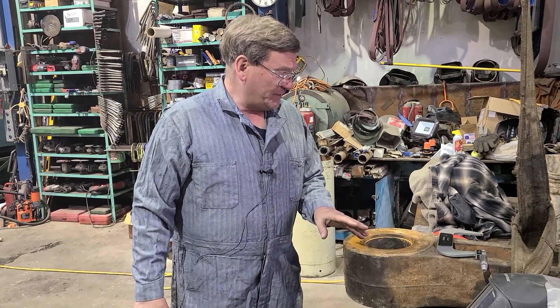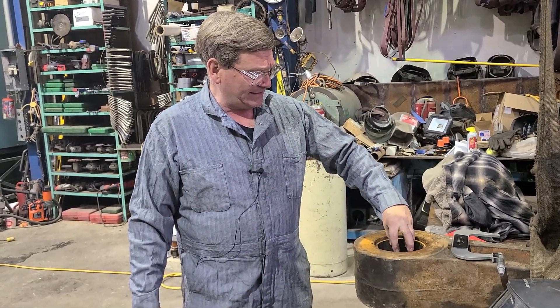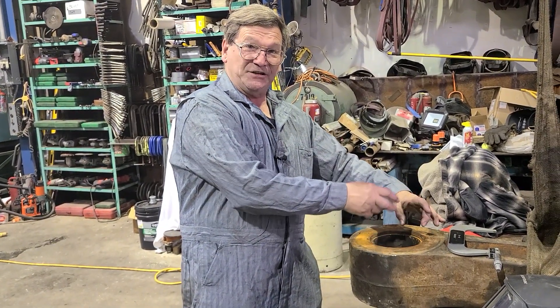There are also people that have made various spiders. A friend of mine — his dad was a tool and die maker and also a heavy equipment mechanic — made him a whole set of spiders for line boring because he did all kinds of line boring. The set had different centers for different size bars, some different little spacers, and a final part where you put gauge blocks in it to make it exactly the size you want. You drop it in your hole — and he said it was so pretty and beautiful, but he's never used it.